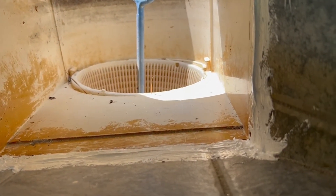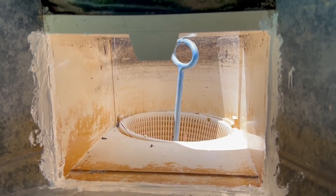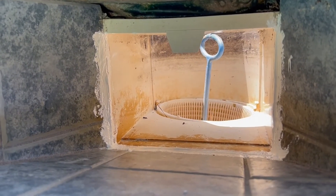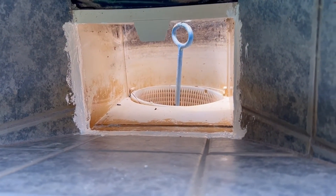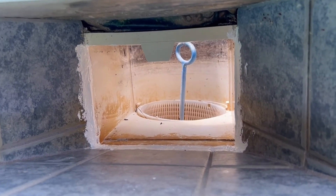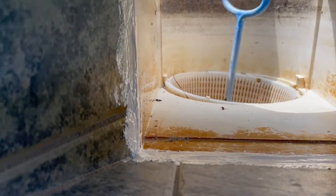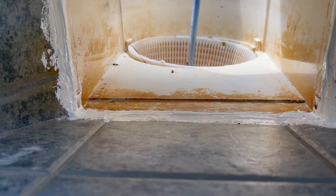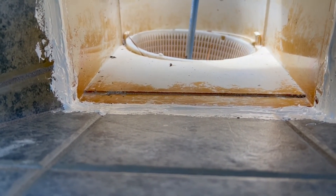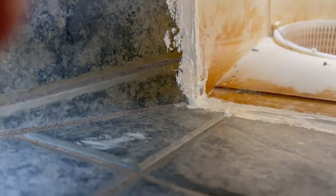I apologize if looking down the skimmer throat it doesn't look all that pretty. If you really wanted to go to extents and people are fussy about that, you could remove the tile, put it underneath the tile, and put the tile back. For customers that really want that done, we're more than happy to do it, but they will need to have extra tile because typically when you're trying to remove the tile you're going to break it. You can see that it forms an excellent seal around it. My recommendation is leave the actual skimmer lid or deck plate off, and also make sure that you leave the actual skimmer weir out when applying this. Make sure you don't cover the holes for the skimmer weir on both sides.